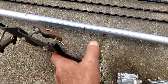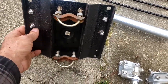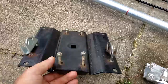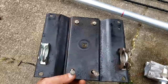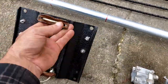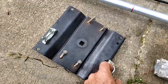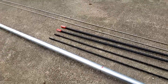I made up a bracket to convert the horizontal boom so it can mount on a vertical pole. Can anyone guess what that plate came from? It was welded to the bottom side of a garden tractor seat — this was the top of it, and it sat on the spring for the seat. It's a good thick piece of steel and it was the right dimensions, so I drilled it and put a bunch of u-bolts on it so I can mount it right to the poles.